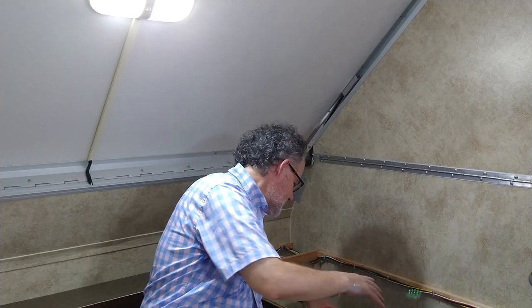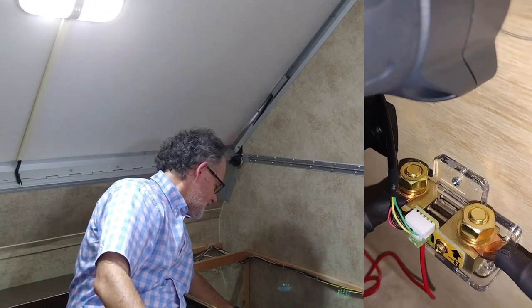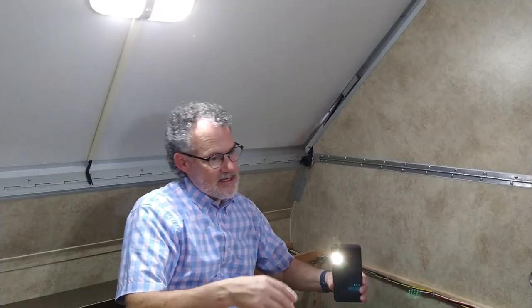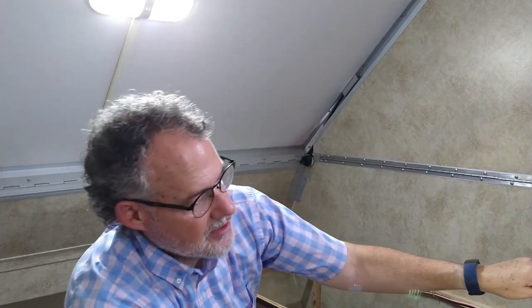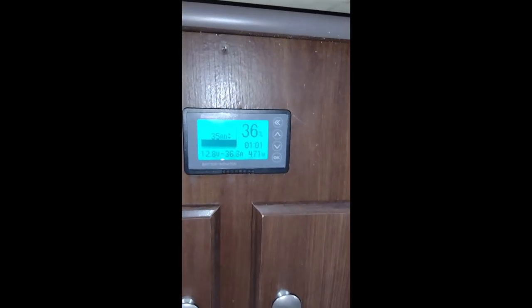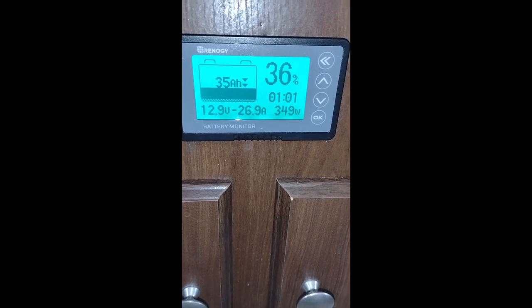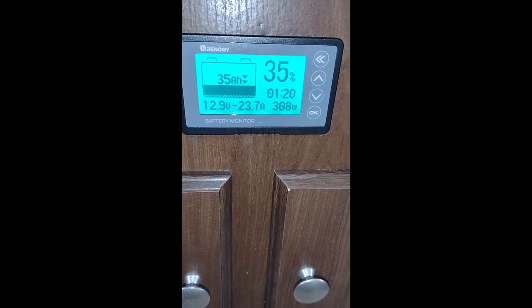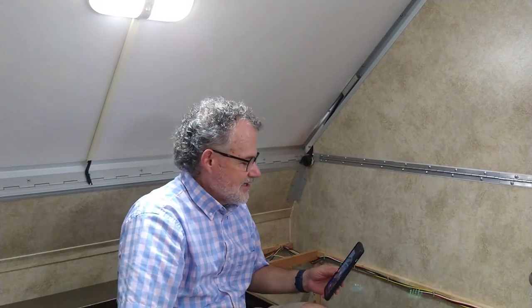Let's talk about this little shunt here. It's there only to insert a battery monitor — it measures the state of condition of the battery and has a little output screen we've installed in the cabinet next to the refrigerator, right by the sink. At the moment the battery is at 36 percent and we're using about 460 watts. That's fluctuating because the sun is fluctuating. Our solar panels are theoretically 500-watt panels but we haven't seen output go over 300 yet — panels do better in cooler weather.